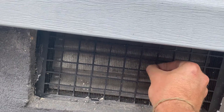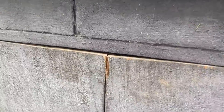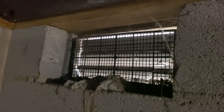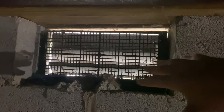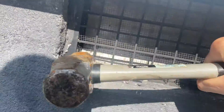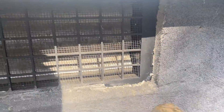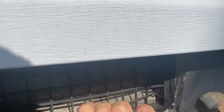This is an example of the vent we're going to replace here. I've sealed off all the other ones and I plan on coming back to do a full encapsulation later. So far I've put a foam board in each vent hole — I'll be sealing that one later. Here's where the new air vent is going to go. I need to knock out a little bit of mortar so things fit and I can pull the vent out, then I'll build a quick little frame out of 2x4s to mount it to. After that, I'll do some spray foam sealing to make sure it's airtight.